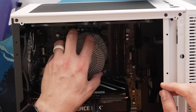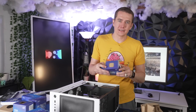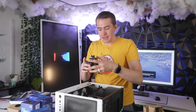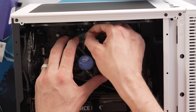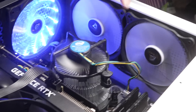We've got contact on all of these. The basic premise is that heat will radiate up through the core on each cooler, and when it gets to the top it'll be dissipated by the fan. The benefit is that you have more core material and extra surface area — each cooler has fins to increase the cooling surface area, and then you just need a fan at the top to blow it all away. This is five — we're five deep on this bad boy right now.